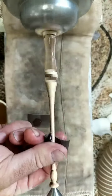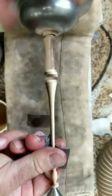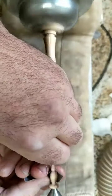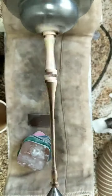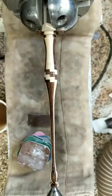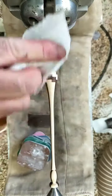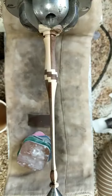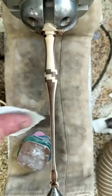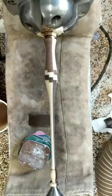And now I'm going by feel. I can tell by feel if I'm there yet. You can stop and look if you don't have the feel for it yet. I'll show you. Let me get some of the wiping. And now you'll see the thing is now evenly dull. There should not be any shiny spots to the wood. Which, if it's all, that's shiny because it's wet, it's all dull. And that's what I'm going for, that dullness.